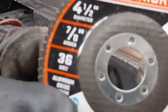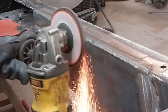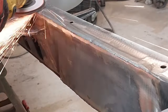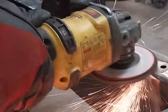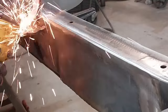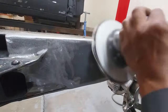Going back to the four-and-a-half-inch 36-grit flap disc — we want to keep that thing nice and flush. We just want to barely knock off the top of that weld, then go to the top side and knock the top off of it. We don't want to put gouges or dig troughs into the metal — you'll see that after you paint or powder coat. With those done we can come back and round that off. Now finishing off with the 36-grit eight-inch orbital.